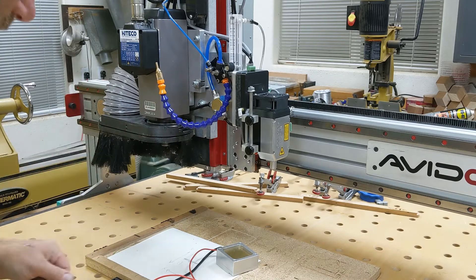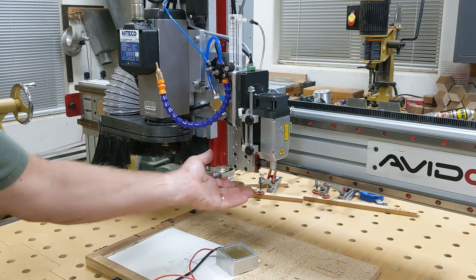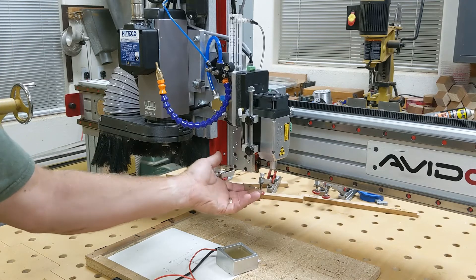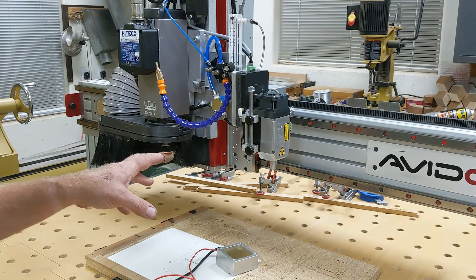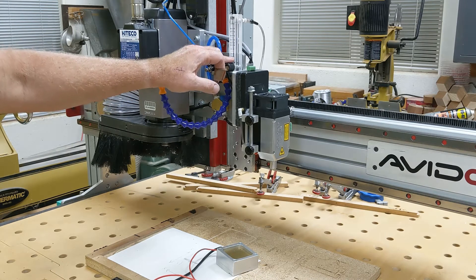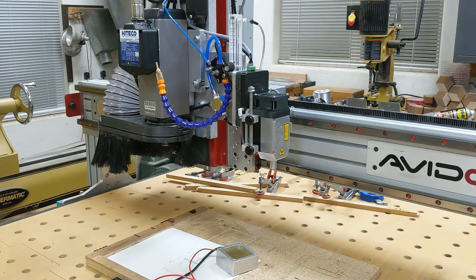The reason it was difficult before was I was using just a regular quarter-turn valve. With the fan running on the laser I couldn't hear the airflow, and the airflow from the cooling fan disturbed the air nearby so I couldn't feel it either. Between hearing and feeling I couldn't really tell how much I had it open. Now with this flow meter I can visually see that I have airflow and exactly how much — I get a number I can repeat easily, whereas by sound or feel you're not very accurate.